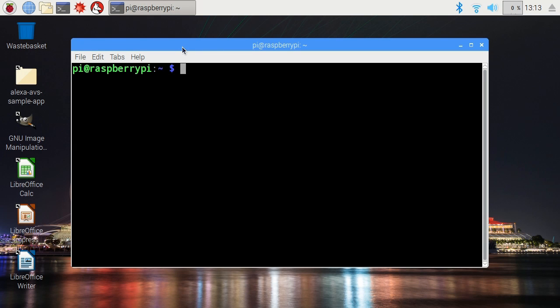And here we are back again. What we now need to do is to set one bit of the Raspberry Pi's one-time programmable memory. Basically, this is setting a bit that tells the Raspberry Pi it can boot from either USB or from the SD card. If you're wondering what one-time programmable memory is, the best way to think of it is like a fuse — once you've blown this fuse, once you've set this bit, you can't change it again. That's why it's one-time programmable.